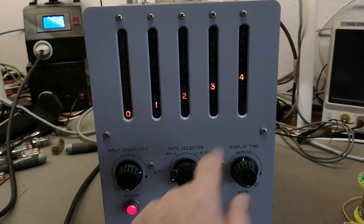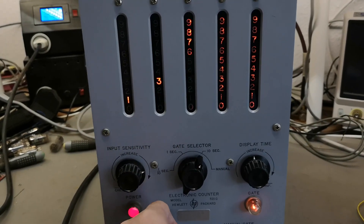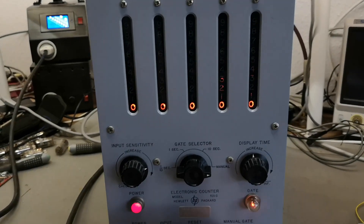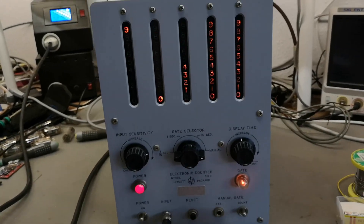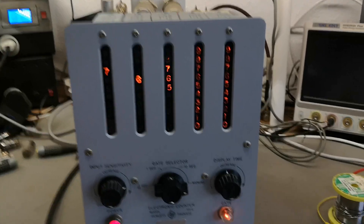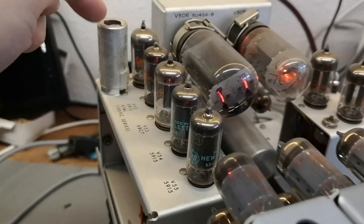Now it's a lot faster and it's between four and five. You can do manual and just — reset — manual. So okay, manual count: count, don't count, count, don't count. 44 tubes and it's working. By the way, I counted and recounted the tubes. The reason why somebody says this thing has 45 tubes is that one is not a tube — that's the crystal!